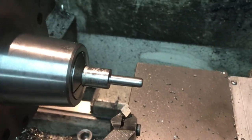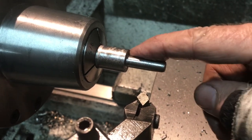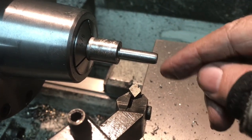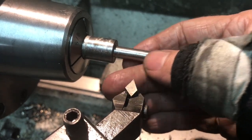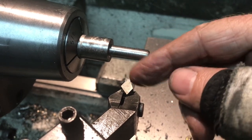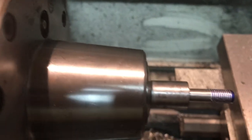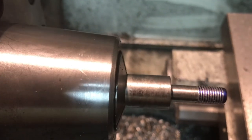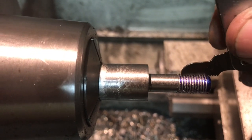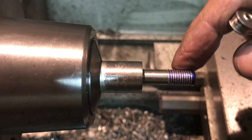For this segment making the bolt, I've taken my piece of 5/8 inch steel and turned the back half down to 5/16ths for a 1 inch length, rounding the edge slightly. I'm using my diamond tool cutter - I love using it for threading. The lathe is set to cut 5/16-24 fine threads, and I'll thread a 3/8 inch section. I took a scratch pass with the diamond tool holder, checked it with the 24 TPI gauge, and it fits like a glove. The threaded portion on the back half is a half inch long.